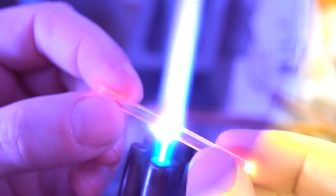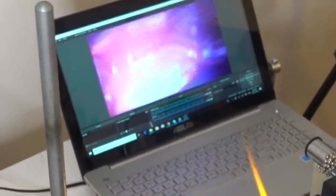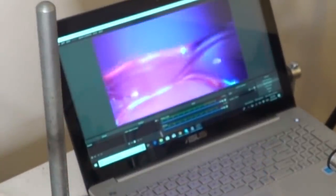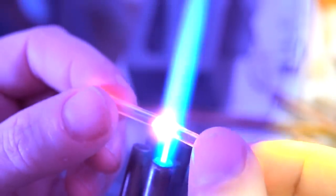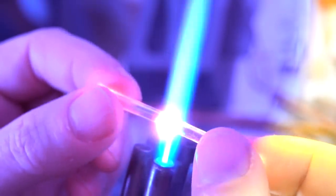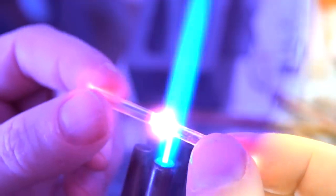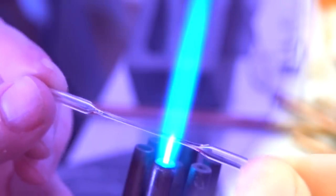You just need to melt it up, push a little to make it thicker. A little bit of a pull, and just let it contract under its own viscosity. When it's just about to close, just pull — nice and gentle pull until it actually solidifies.